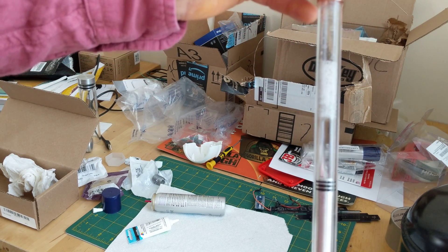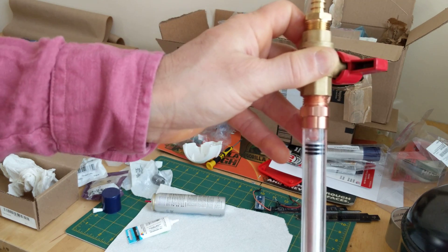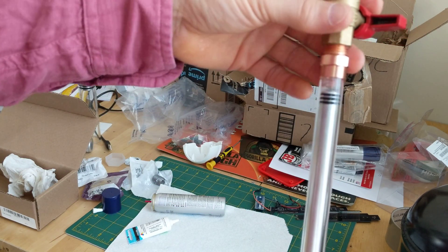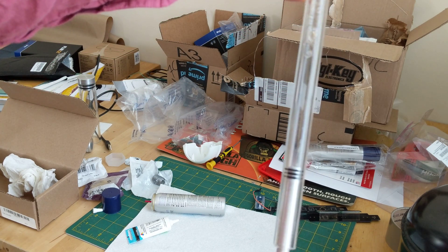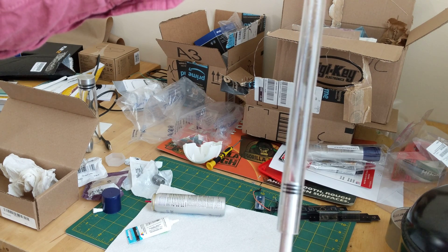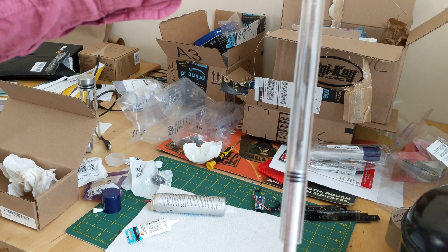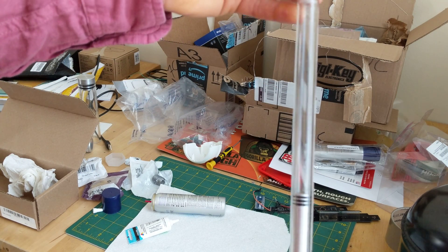And then uncompress it, it turns back into a gas and boils. Now every time I compress it, it's actually getting warmer, and then it's rejecting heat mostly into this aluminum piston rod. And then if I pull it out and it evaporates into a gas, it needs heat — so it's stealing heat from this rod and it's getting colder. Hopefully I'll get a thermal camera on there to be able to see that change in heat as it expands and contracts and turns from gas to liquid.